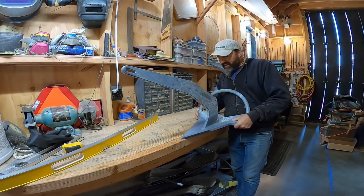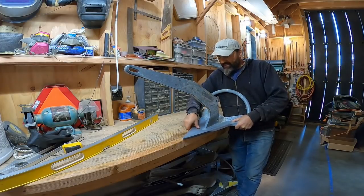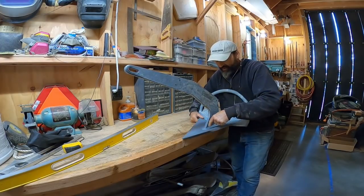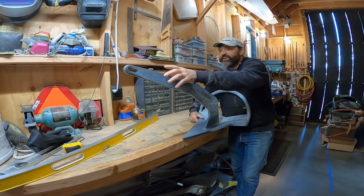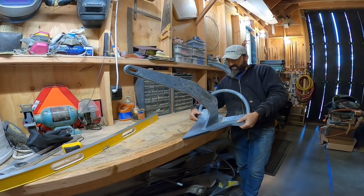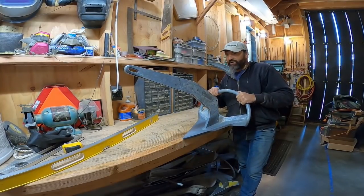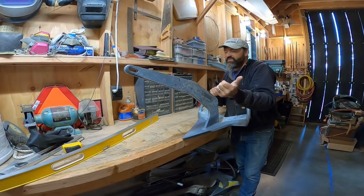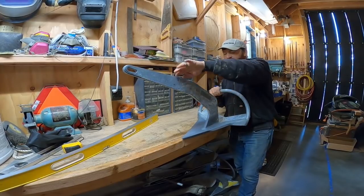And, you know, if I was the guy welding this shank on, I would have affixed the fluke into my jig or whatever, get its geometric center lined up. And rather than line up the geometric center of the shank base, I would have rather lined up the chain attach point with my center line. And I can tell you, if I do all this, sighting along the edge of my bench, I can tell you with absolute certainty that the chain attach point is not on the center line. It is deflected probably almost an inch. It's actually more than the amount of curvature in the shank itself.